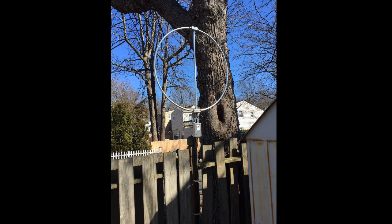It is pretty small — it's a meter in diameter. So again, another plus for people who may be restricted by covenants, HOA restrictions, or who are apartment dwellers. This is a great way to get on the air and at least receive well, having a good pair of ears on the HF bands. Good from 100 kHz up to 30 MHz, so we're talking way below the AM broadcast band if you're into medium wave and long wave DXing, beacons, or even the new 630 meter and 2200 meter bands. This antenna will do the job all the way up to 10 meters as well.